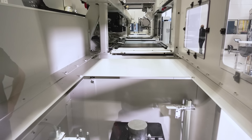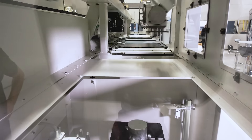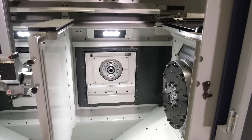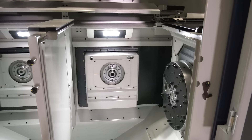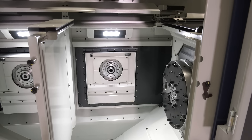This isn't the only way to turn parts — there are machines with opposed spindles and multiple turrets. What's the biggest difference between that style of machine and what you're presenting here? The difference between opposing spindle and parallel is the turnover unit itself. Every component needs up to 30 seconds to transfer from spindle to spindle, and what this machine does is perform that transfer in-cycle whilst you're still machining. So you end up with a flow where you're machining OP10, machining OP20, and actually turning over the component ready for OP20 whilst you're still machining — so you get that bit for free. The speed of this is incredibly rapid.